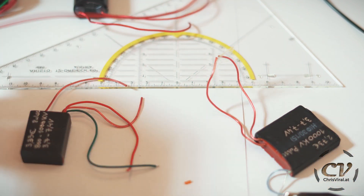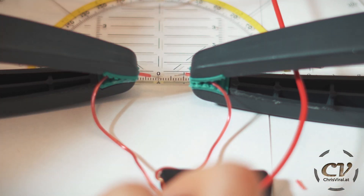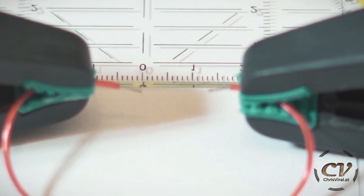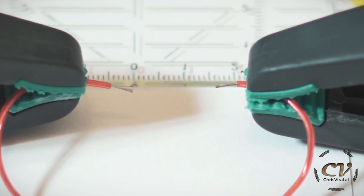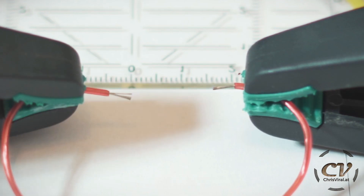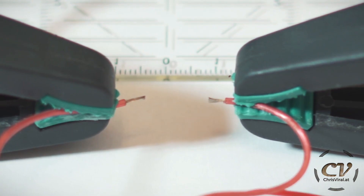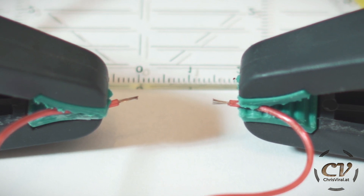This one works. This one works too. Hell yeah, that's amazing. Let's start with the flat one. Maybe that was the reason — wrong polarity. At 7.3 volts actually. So this one definitely can take the voltage. Let's amp it up to 7.4. Hell yeah. This right here is a 13 millimeter gap. That's the limit right there. Looking like a 16 millimeter gap right here. 16 millimeters it is. And the last pulse module. Right there — that's about the limit. And this is only a 15 millimeter gap. Let's give it 15 for a bit of variety. This was also at 7.4 volts.